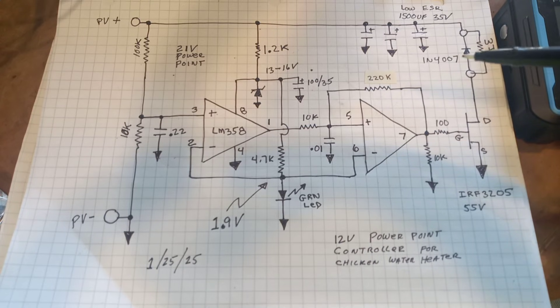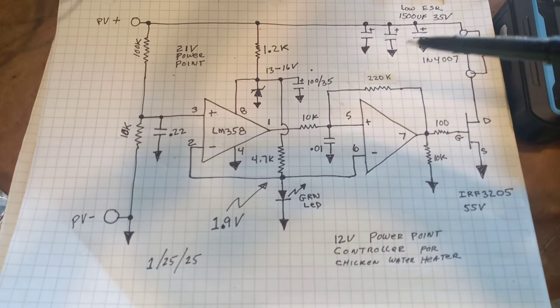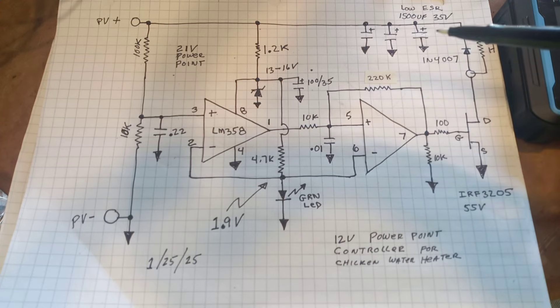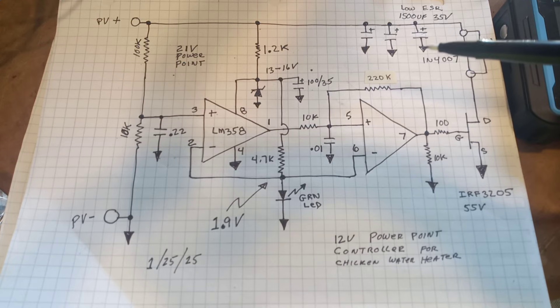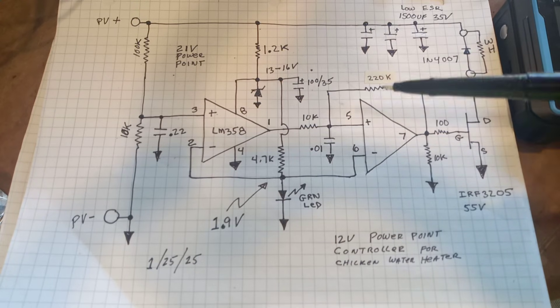I did one once with about 15 or 16 capacitors all in parallel — the more capacitors the better because that gets your ESR down. You don't want one big 4000uF single cap. Most caps are only rated for about 1 amp. My big caps used on my controllers are rated at just 3 amps each, and that's average current. You want something rated for current with construction good enough for high current pulses, because you're always pulsing at the maximum current — the time may vary but it's always the same high current.